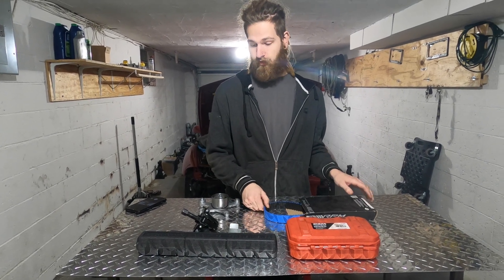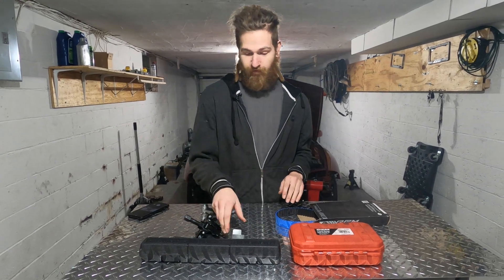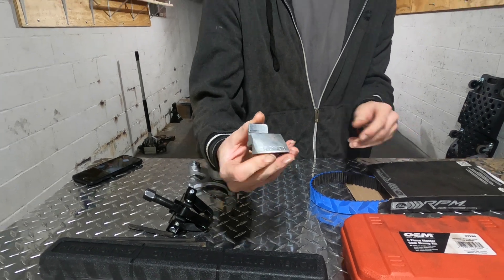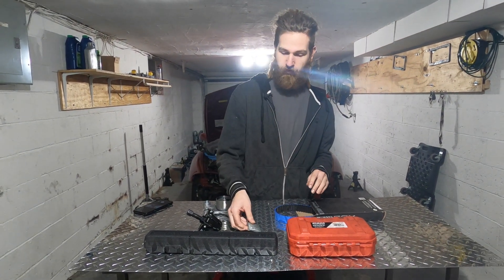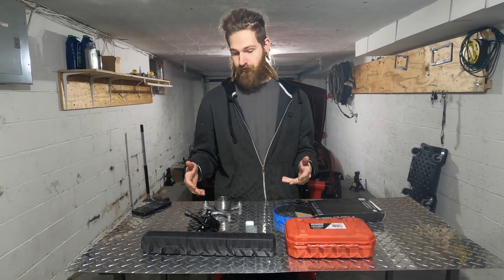You don't want these breaking — going to cause you some bad times with your valves and stuff. A couple of tools you're going to need: you're going to need a stretch belt remover tool. I think this is by Gates as well — this is to get the alternator belt off. I'll try to link whatever I can link down in the description so you guys can find it.